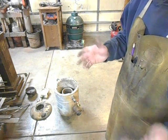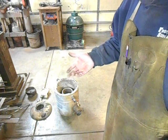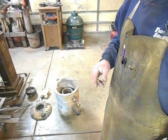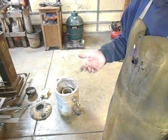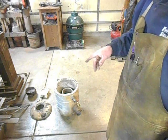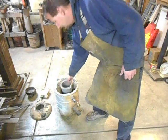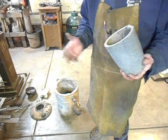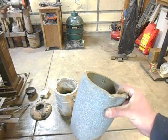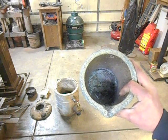So I started playing around with different things, and found that mild steel works pretty good for most aluminum. Stainless steel — you can make crucibles out of stainless steel scrap that works really good on brass and also works good on aluminum. And then for copper and iron — I did do an iron pour the other day, but I didn't check to make sure that the camera was rolling before I did it. I just hit the on-off button and figured that would be good enough, and it wasn't, so I didn't get a video of that.